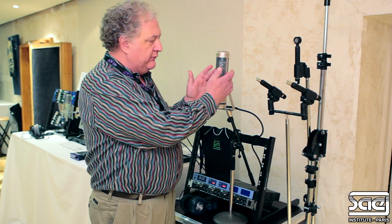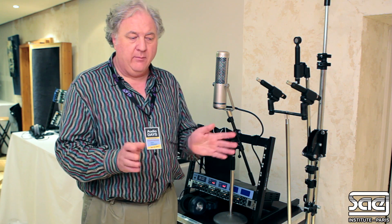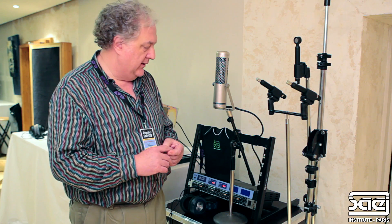These two microphones, the 715 and 716, are the result of research we've been doing for many years on the effect of acoustic reflections inside the microphone basket, which can cause a problem. Here you can see on the sides of the microphone there are bars that hold it together. In every other microphone of this sort, where you have a grill or something like that, there is some structure that causes reflections. The 715 and 716 grill is made of hard aluminum foam — it looks like plastic foam but it's made from aluminum — and it has a uniformly distributed, very low coefficient of reflection. So many of the high frequency problems you hear in microphones due to reflections inside the grill are removed in that way.